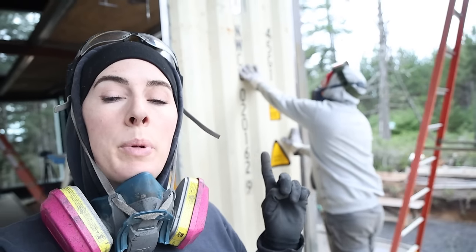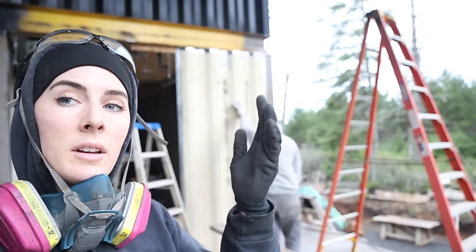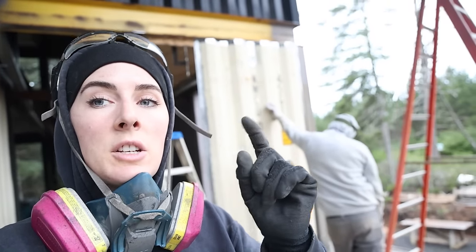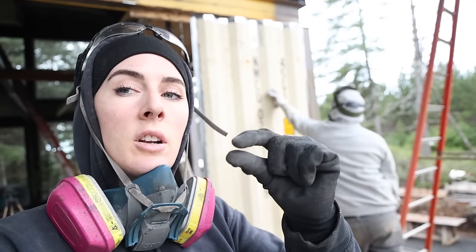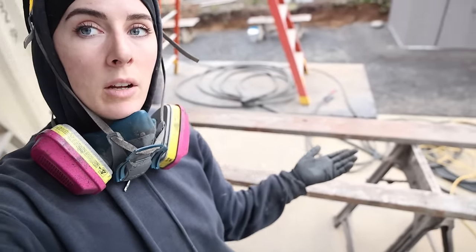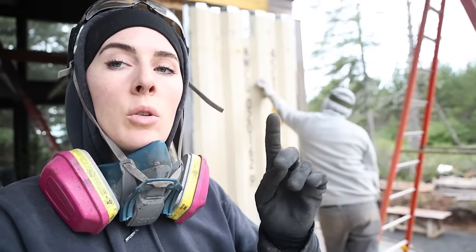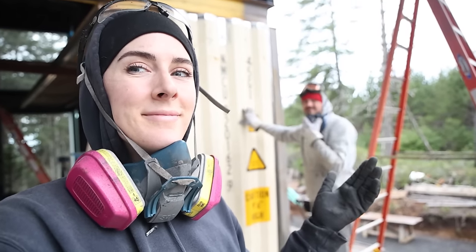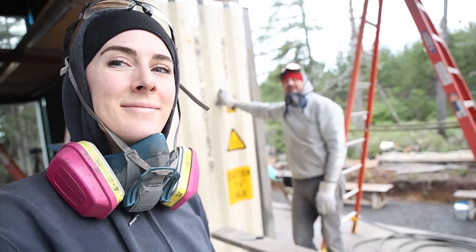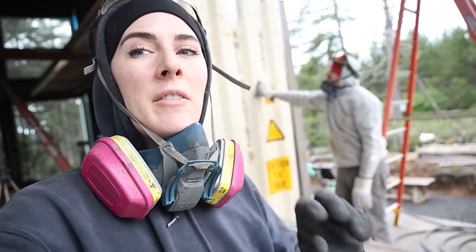Okay, so we have the panel in the opening right there, and there's one little section up there, right along that side. That's just a little bit too big, so we need to put the panel back on our sawhorses right here and grind down that little section so it will fit in the opening, and then we should be ready to tack it into place. We have to grind about 1/8 from the top. Yeah, it's not much. Just fitting everything is always like, you know, little adjustments.